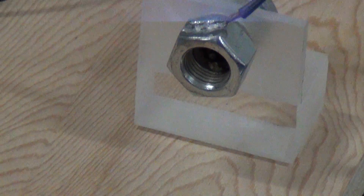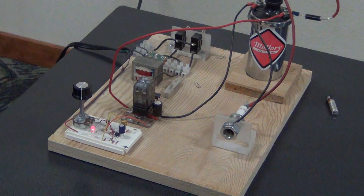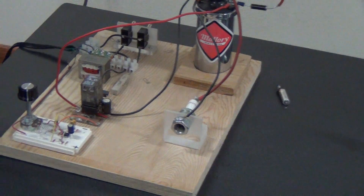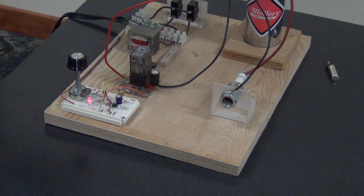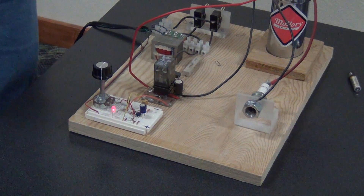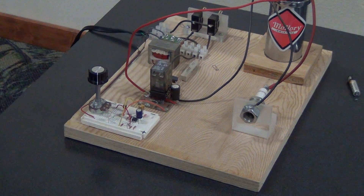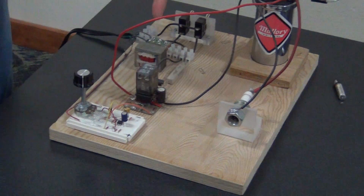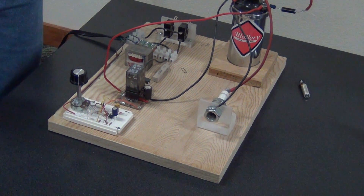Is that the kind of modification you're interested in? By getting a hotter spark, it's giving you better economy, right? Well, much more than that. When you look at this on an oscilloscope, without this little modification the capacitor discharges in about 150 microseconds. With this component in the loop, it discharges in 5 microseconds. It speeds up the discharge — a lot faster. The power density is... the same number of joules in every discharge, there's no more energy between this state and this state.